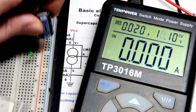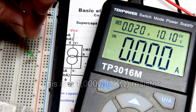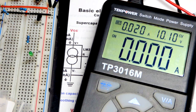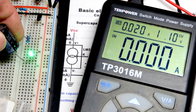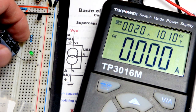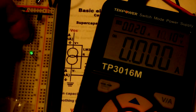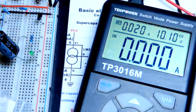We'll take this resistor — it should be set about as wide as the capacitor when you also include the LED. I'm going to put the negative side of the capacitor to the cathode, the short lead of the LED. Now you see the LED lit up — that stored charge is now powering the LED. That's really more of a use for supercapacitors. As you can see, we slowly faded down the brightness of the LED — it can still glow a little. So it can power things for a while, but it loses its power over time.